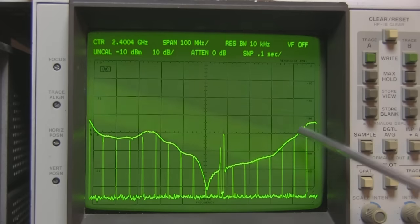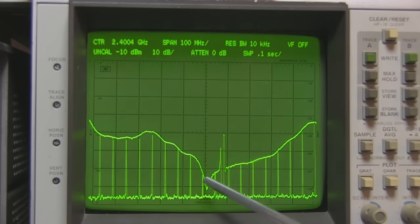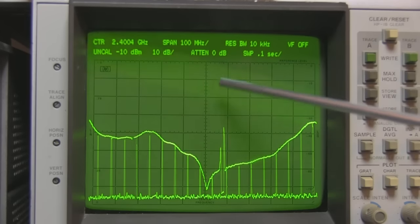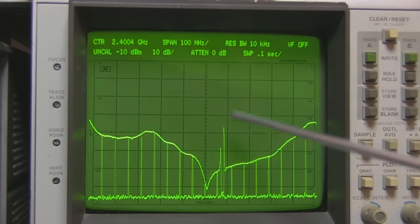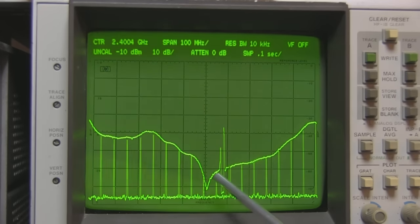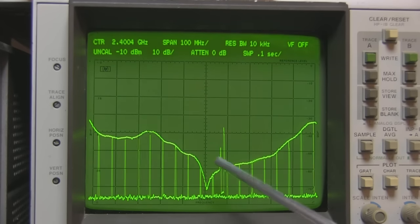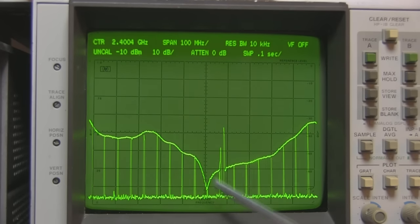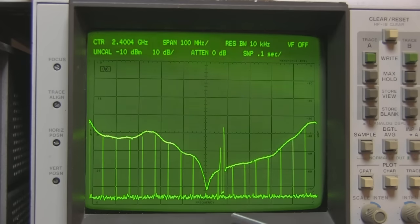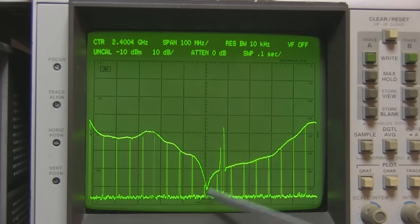Here's the image on the spectrum analyzer, and the first thing I notice is how clean this waveform is — I don't think I've ever seen it as clean as that before. You can definitely see the peaks there of that wave. This is our frequency response; I've got it set at 2.4 GHz here, and this is 2.5 GHz where we've got the peaks — I'm still looking into what's causing those. This antenna just wants trimming down a little bit to move the response over slightly — I'm probably only talking about a very small amount, something I'd do with a fine file rather than side cutters.